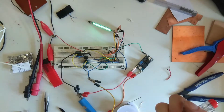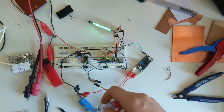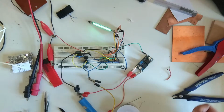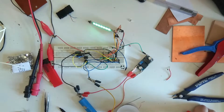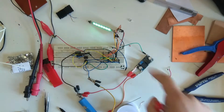So what I'm doing is, this is the prototype for the circuit, the first prototype I built. It has an 18650 down here powering it. It just goes to an off-the-shelf boost converter module, because the VFDs need a fairly high voltage of about 20, 25. This is running at 30 at the moment, so this is why it's very bright. It's swamping out the camera. If you look at it from where I'm standing, it's much better. You can see the dots, instead of just this sort of bar. But it's because the voltage here is so high.